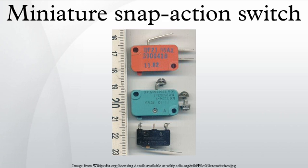They are usually rated to carry current in control circuits only, although some switches can be directly used to control small motors, solenoids, lamps, or other devices. Special low-force versions can sense coins in vending machines, or with a vane attached, air flow. Microswitches may be directly operated by a mechanism, or may be packaged as part of a pressure, flow, or temperature switch operated by a sensing mechanism such as a Bourdon tube. In these latter applications, the repeatability of the actuator position when switching happens is essential for long-term accuracy. A motor-driven cam and one or more microswitches form a timer mechanism. The snap switch mechanism can be enclosed in a metal housing including actuating levers, plungers or rollers, forming a limit switch useful for control of machine tools or electrically driven machinery.